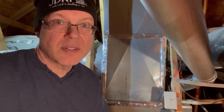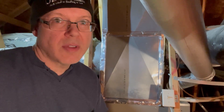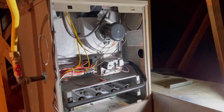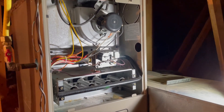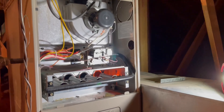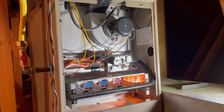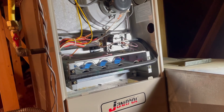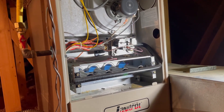Now I'm going to test out the furnace — jump into the Nest app to save a trip down the ladder — and turn this on, make sure everything works. Furnace just turned on, blower motor running. Right now the igniter should be heating up. And if all goes well, we'll see flame. There it goes — you can see the igniter glowing, gas turns on, flame. While I have the panel off, I'll do some minor inspection, make sure there's no blowback or anything else strange occurring. Motor sounds good. All in all, changing out the switch is all it took.